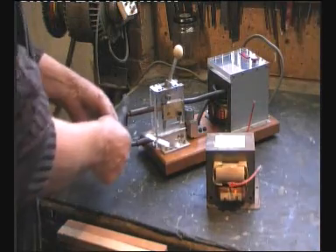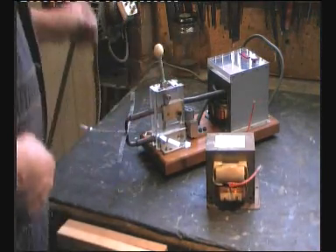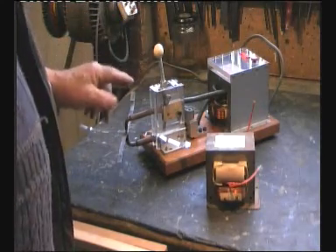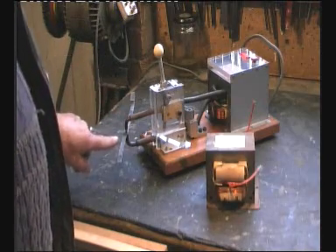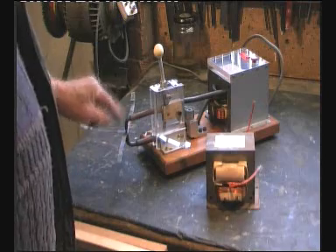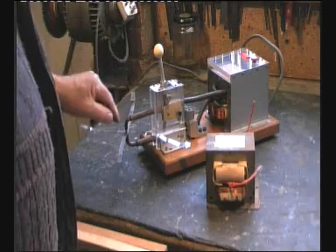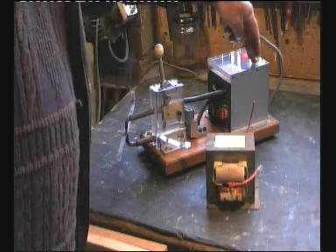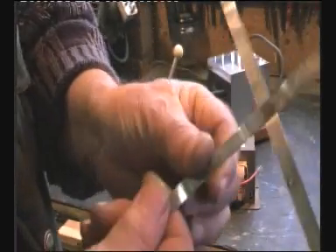I've used big brass connections — big nuts and bolts — to get the best electrical connection between this heavy wire. We don't want any losses. If we're going to have half an ohm of resistance, that's the principle by which spot welders work. If we take two pieces of metal and put them in there and switch it on — if we're going to have half an ohm or a quarter of an ohm, we want it at the interface between the two pieces of metal. It is that resistance that heats up and makes a molten ball. So if I just switch on and take that apart — that's the spot weld we've got.